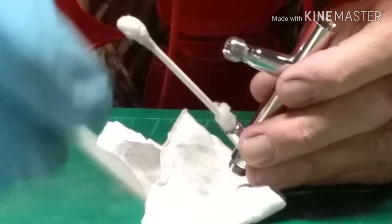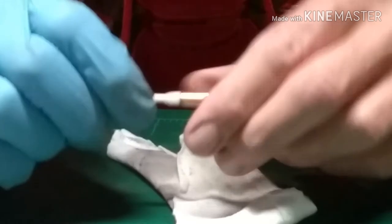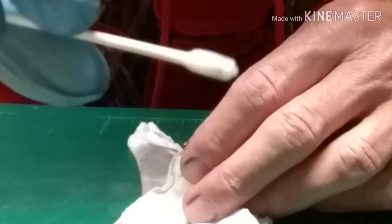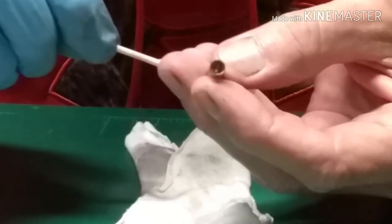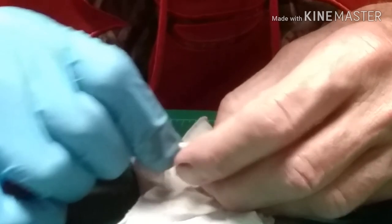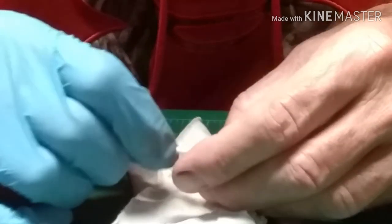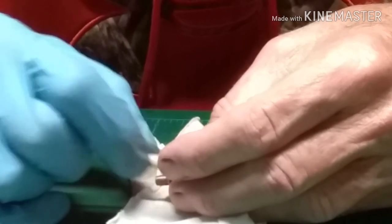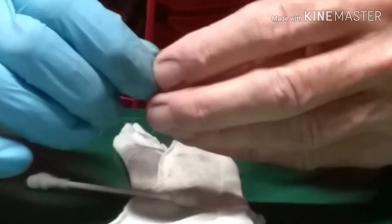I wanted to go back to this insertable collar sleeve for the air valve — this is important. There's not a ton in there, but you can see there's enough of a dark ring in there that seats right up against the end of that valve to draw my concern, and there's also enough on the outside. If you get really brave you can use Flitz, but I wouldn't want to — Flitz does change metal dimensionally even in the thinnest, most minuscule amounts, and you saw what a tight pressed fit this was. You could also polish your needle and trigger with Flitz, and at some point I may do that, but not now.